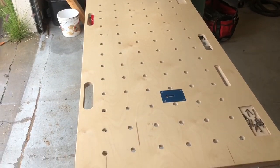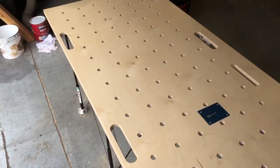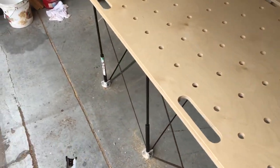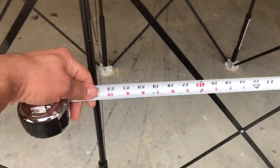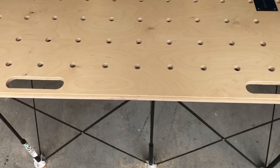As you guys seen when I purchased the half inch Baltic Birch, it came in a 5x5 sheet. You can get it in 4x8. You can make it out of 3/4 if you want. You can do whatever you want. I made these out of 1/2 inch because the centipedes have a center support, so it's only spanning 23 inches from support point to support point at its farthest point.